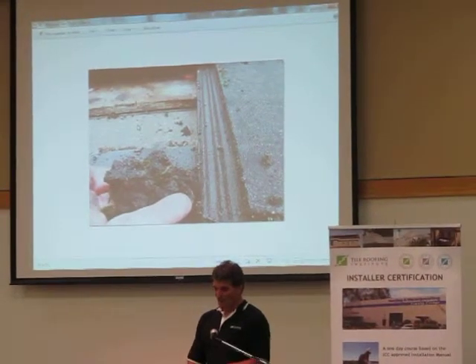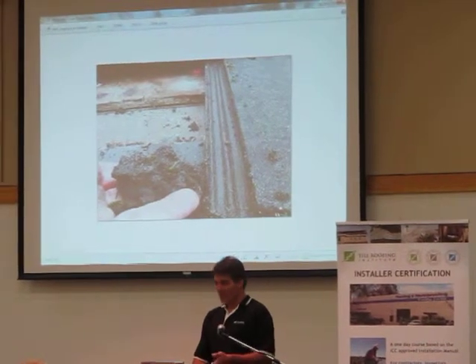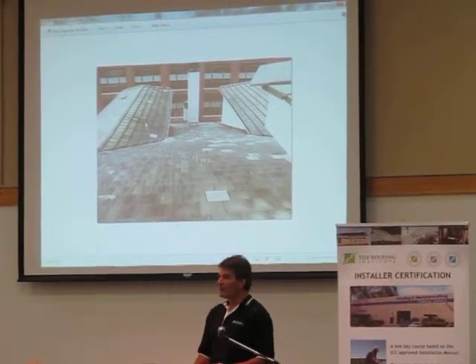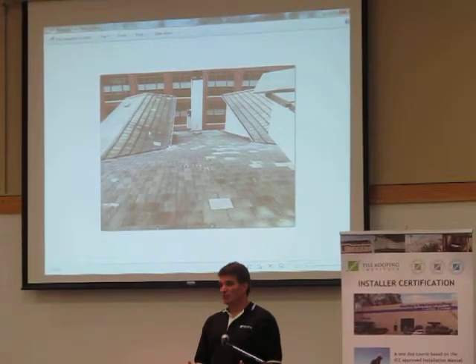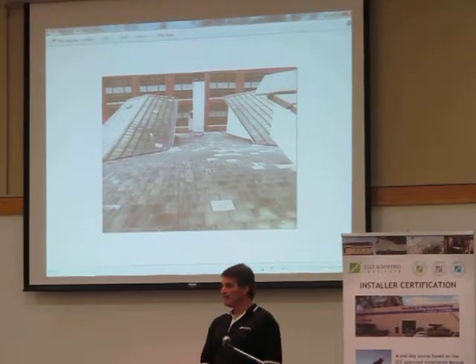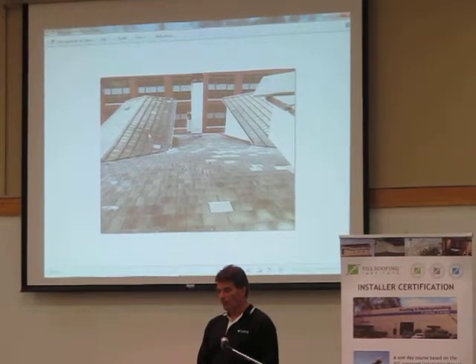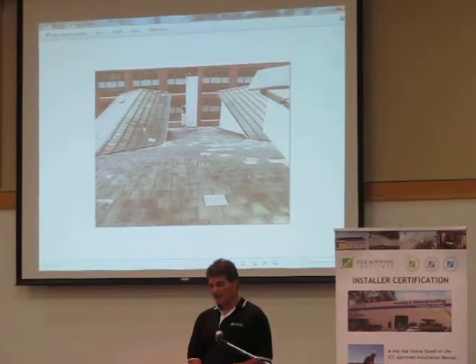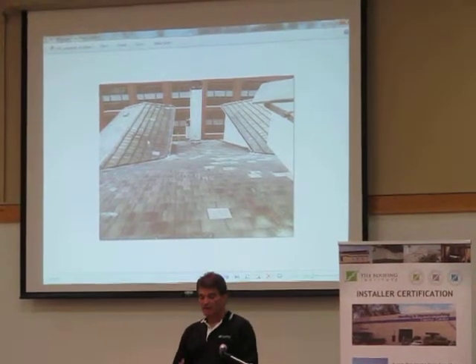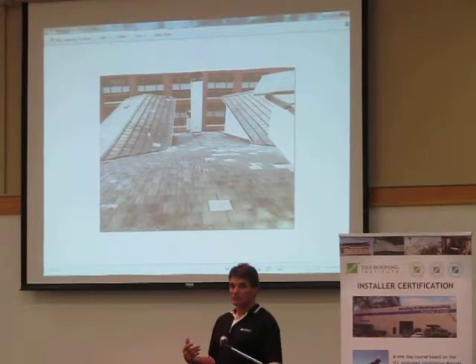You can see how much comes out of there, what it looks like when it's clean, and how effective that would be. What complicated this one — something to think about on larger buildings — is that concentration of water can be tough for a tile roof to deal with if there's no consideration for it. In this case, it's a large commercial building in downtown Seattle where the gutter-to-ridge run is 52 feet.